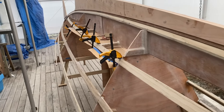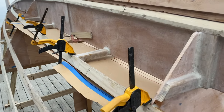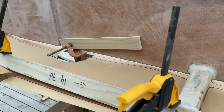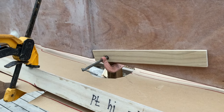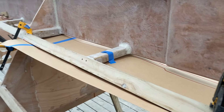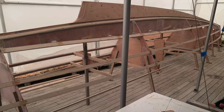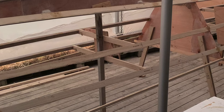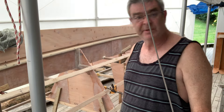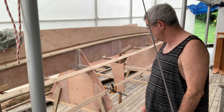We've been having fun and games trying to draw the templates for the floors. We've got some card underneath that we've clamped into place and drawn around all the bits and pieces. We've had to cut a big hole in the middle because we've got a support strut underneath. That's the floor of the galley. We braced up the stringers — the space is more or less halfway in the saloon and the galley with what amounts to a temporary bulkhead, wired in with copper wire, and we'll cut those out and remove them later. We're setting up now to put in our first sheet — the side panels or hull sides are going on.